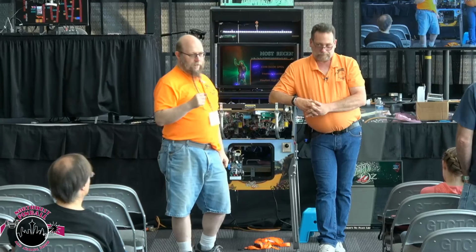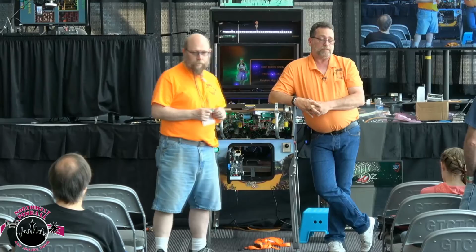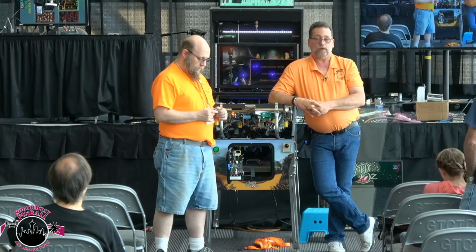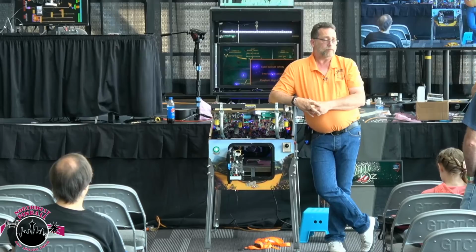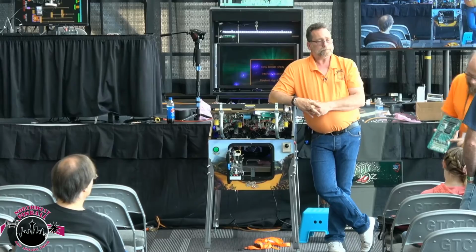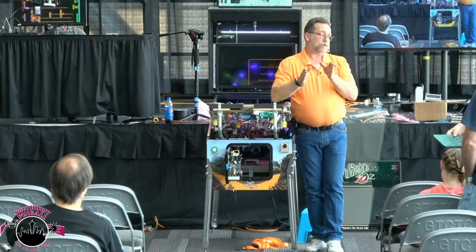The two main sizes that you're going to need are 1.0 millimeter and 1.6 millimeter. 1.6 millimeter does your 0.156 headers and any large capacitors or bridge rectifiers. Your 1.0 millimeter will do all of your smaller transistors, smaller caps, everything else. You look at this board. The tip you would use to desolder this is going to be a considerably larger bore hole than this. I'll definitely show you that when I show you those two desoldering guns, because in the 808 I have a 1.6 in, and in the FR300 I have a 1.0 in.